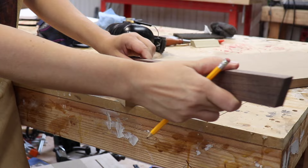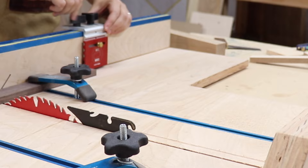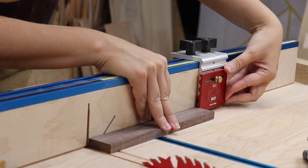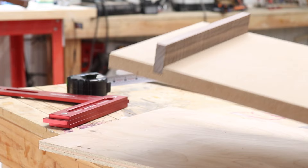I needed a really tight friction fit so that when I use the half-inch router bit on all the attachments, it's going to be a great fit. This fence just needs to be roughly the same width as the jig, but I just got a new stop block from Jonathan Katz-Moses and wanted to test it out. It wasn't completely flush against the MDF, so I played with the micro-adjust settings, moved it in a tiny bit, and got the piece perfectly flush.